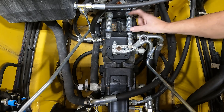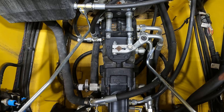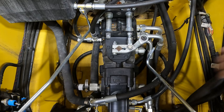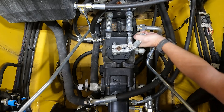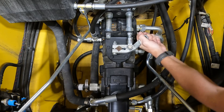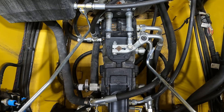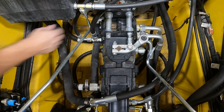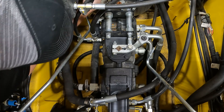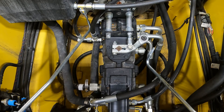The first thing we're going to look at is the spring pack — are the spring packs automatically bringing the pump back to neutral? The spring packs are set in between the bracket and the top of the pump; there should be no play between the spring pack and the brackets. If I grab the lever and give it a slight tug back and forth, I can feel no play on the left pump. Repeating on the right side — give it a little wiggle — you do not observe any movement in that spring pack. The spring packs are set correctly.